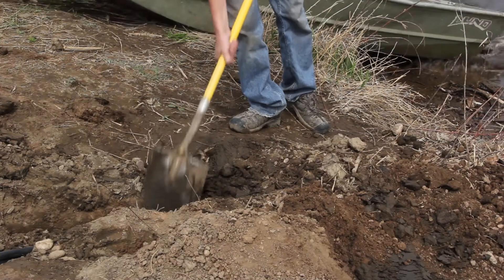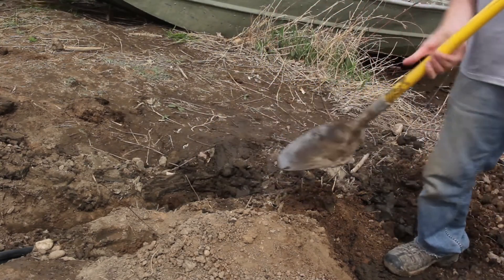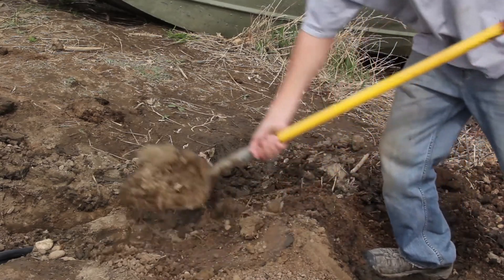When you're all done hooking up all your lines, fill in your trench. It's best to have your tubing at 8 to 10 inches below the surface so that it cannot be disturbed from above.